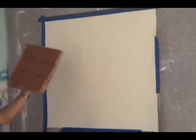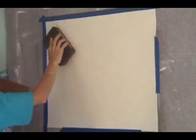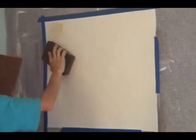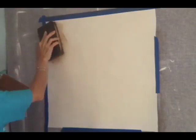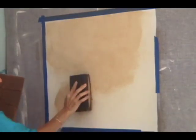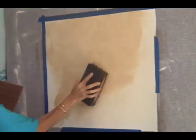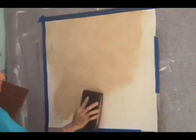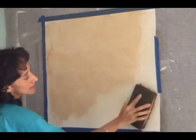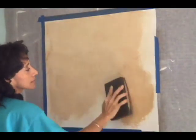Keep the finish to one color though. First, load your palette and take your poofy pad and press it onto the palette and then onto the wall. You proceed to kind of wash the wall and then pounce out the swirls. The glaze will dry quickly this way, so you want to wash swiftly but only do a small section at a time so that you can fade out the edges as much as possible. Continue to repeat this step, blending one section into another and pouncing out the swirls.